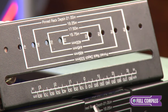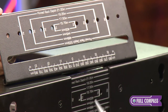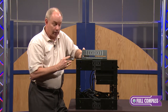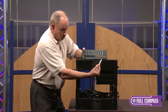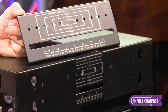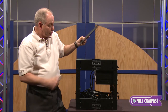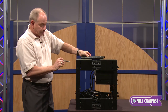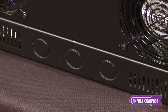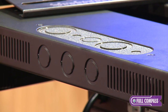At 2U you can drop in a fan panel or vent panel. In millimeters or inches, as you go out to 2U on the graph, it tells you the overall depth of the rack so you're always in control of understanding where you're at. It takes a lot of the guesswork out when you do a pre-measurement. So again: 4U to 44U, 14 inches to as much as 28 inches deep, with accessories that go with. There's also an ovoid in the top and bottom — a supplied piece with conduit knockout, plus three conduit knockouts on the rear on either the top or bottom, and two half-inch knockouts for mounting dual-diversity UHF antennas.